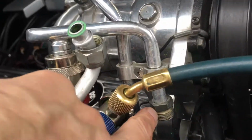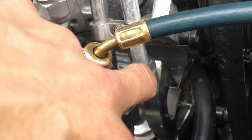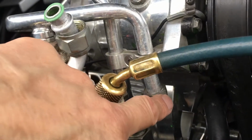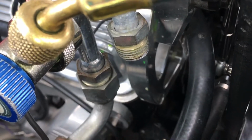You see these nuts, the way they're attached like this? These are supposed to spin. This was seized up. Somebody over tightened this. This was over tightened before, and I couldn't get this to move. I had to get a wrench to break this free and get it nice and rounded and moving. So I put a little bit of the NYLOG on the back fitting, and if you look really close, let me zoom in. This is really flattened out because it was over tightened.